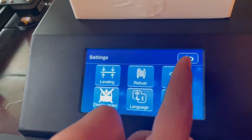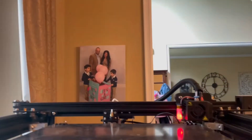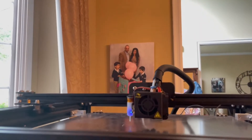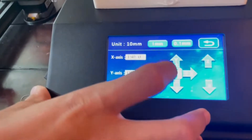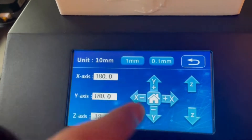After your auto home has completed and you're inside of the leveling menu, you can go back into settings and navigate back with the back button and go into the move menu. Then you can re-auto home if you choose. I'm going to do that since mine has since moved around. Now that your auto home is finished, you can see the Y-, Y+, X-, and X+ controls. You can move the head around in the X and Y axis using these controls.